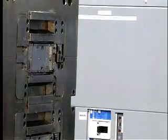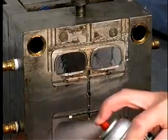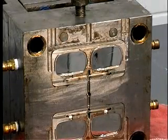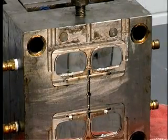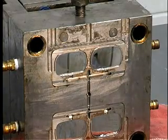In the tool room, apply the cleaner in sweeping motions, thoroughly flooding the mold. Many Slide mold cleaners have a fast-evaporating formulation, so you can quickly apply a rust preventive after cleaning.